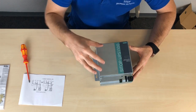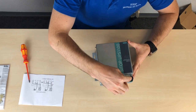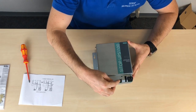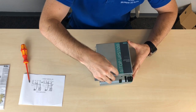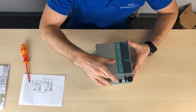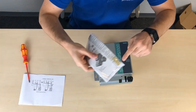There are three important connection points. We have the mains, which delivers the 24 volt power from the batteries. We have the communication connection X2 — two connections there that go to the UPS. That's responsible for linking the intelligence in the device to your UPS, giving you information like testing cycles, temperature, and all your charging curves, which are pre-loaded on our circuitry. The last one is the fuse — a 15 amp fuse — and we've included two sample fuses for you to get started.